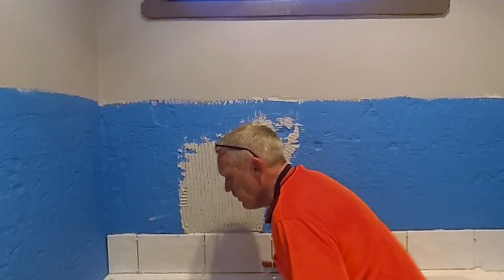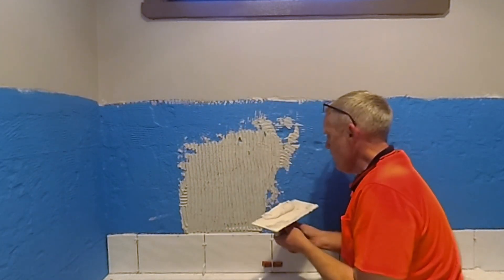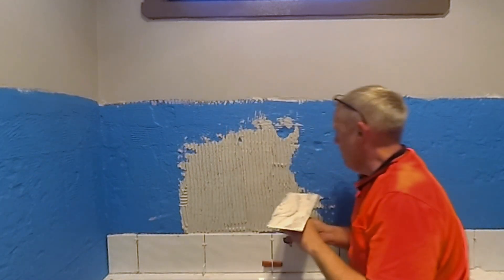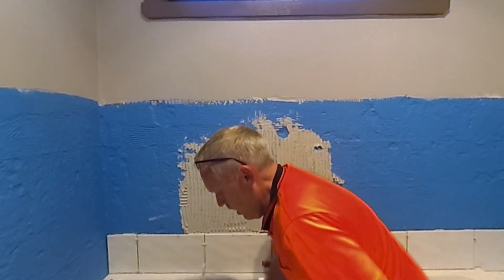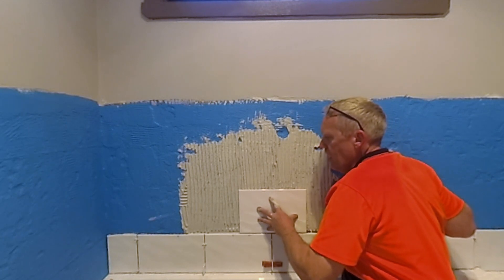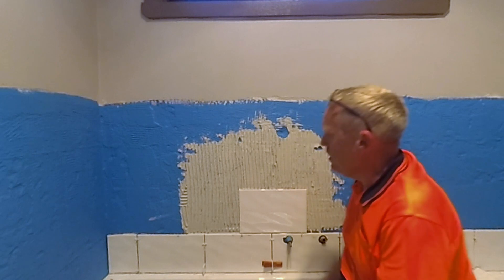Then when you push the tile against the wall, I'm going to need a little bit more glue on here - I'll load my trowel up first. If you haven't seen it already, take a look at our video on how to mix glue - it'll give you the ways to get the right consistency. Got glue on the wall, and then it's simply a matter of putting the tile on, pressing it up, and always give a little vibration left and right - that just spreads the glue out. Then put a couple of spacers in: spacer one, spacer two. Then go do the next one.